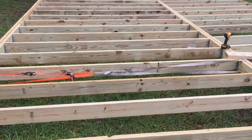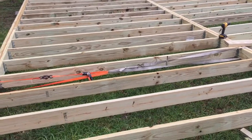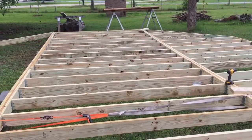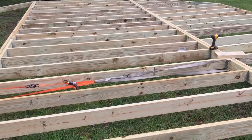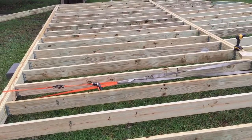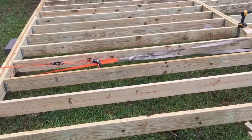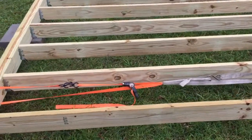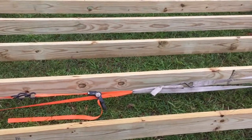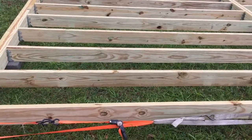Last night, I've been wondering how I had some gaps in my joist where the beam bowed. I had it square to within a quarter of an inch as far as this big rectangular section is concerned. So I was wondering how I can pull in those gaps. Last night, I don't know why, but I dreamed about all this. My dream was to attach some of these ratchet straps and pull it together. So I did that, and it worked. It pulled the joints up tight. And now all I've got to do is attach the screws, hopefully, and keep them in place.